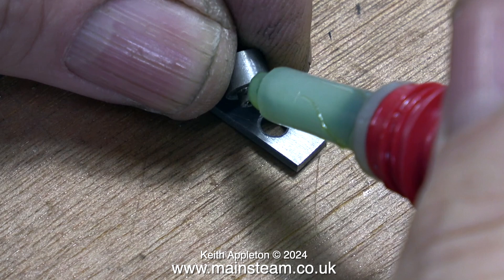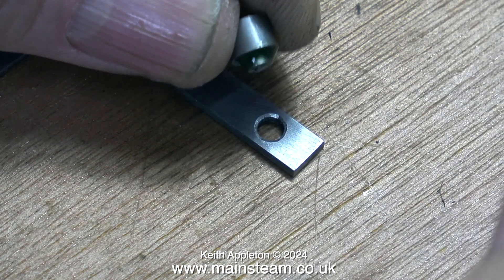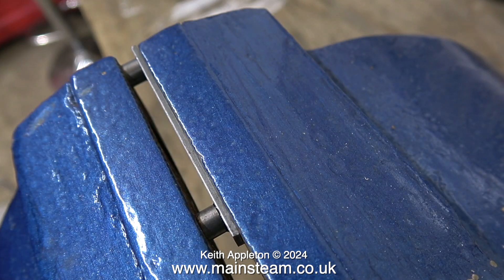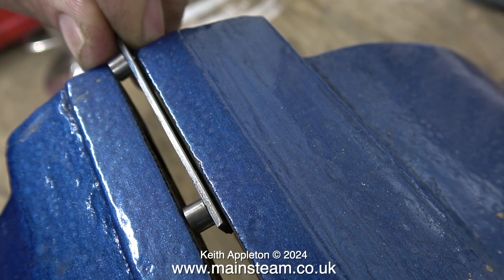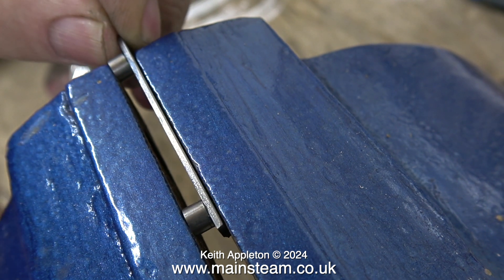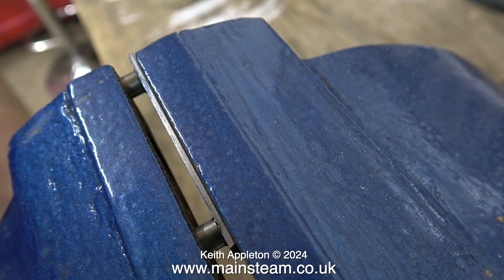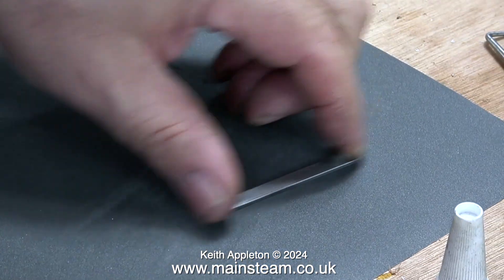Not only will this allow the small parts to fit perfectly against the pieces of flat bar, it will give a bit of a reservoir for some extra Loctite. I'm using Loctite 603 here, and from my experience this is a better method than silver soldering the bars. Once I'd applied the Loctite to both of the small barrels and fitted them to the bar, I temporarily fitted them in my vise and applied some pressure to hold them together until the Loctite had set. Some Loctite runs out of the joint as I tighten the vise. After the Loctite cured on the first part, I clamped the second part in the vise the same way about an hour later.